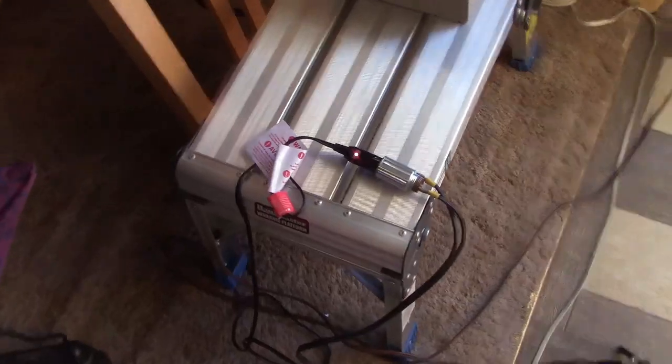This one only takes 55 watts, so 4.6 to 4.7 amps. The panel is 100 watts, 6 amps, so it easily handles that with plenty of power to spare. Been using it all morning sitting there editing a program.